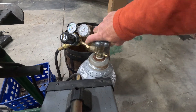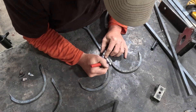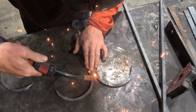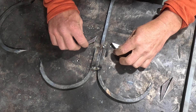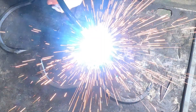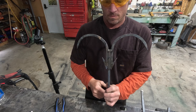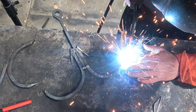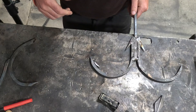Here's the basic layout. Now what I need to do is a lot of welding and a lot of grinding. Initially I was going to put some rivets through those tines to the main stave, but I decided it'd be better to weld everything together and make it as bomb-proof as possible. I was intending to test this — I don't think it's possible to make a grappling hook for climbing and not actually put it to the test, which we will get to at the end.